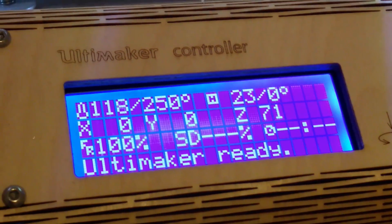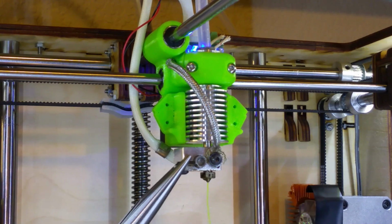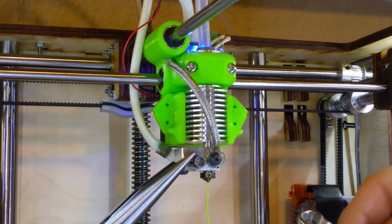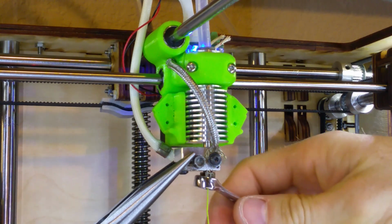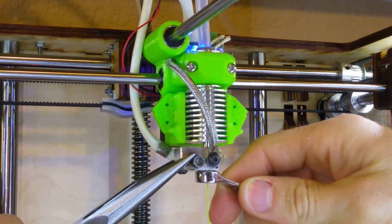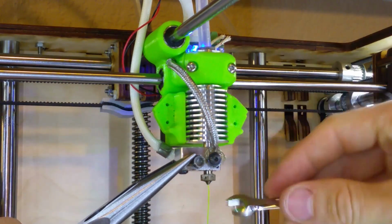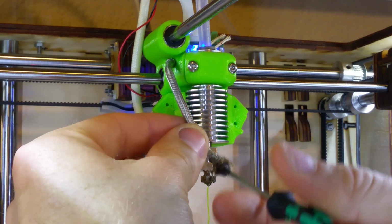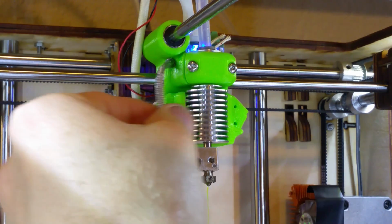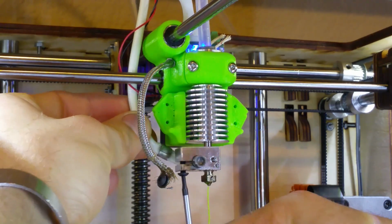First, set the hotend to 250C because we'll be needing to loosen the nozzle and remove the heat break and aluminum heatsink to reuse in the Volcano Assembly. After the nozzle is loose, make sure to turn off the hotend. This is super important because the next step of removing the thermocouple will cause the heater to get dangerously hot. With no temp feedback, the printer will unknowingly heat up the hotend well past a safe temperature. Be careful, you just heated everything up so the parts are going to stay hot for a while.